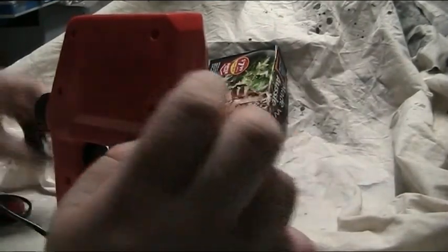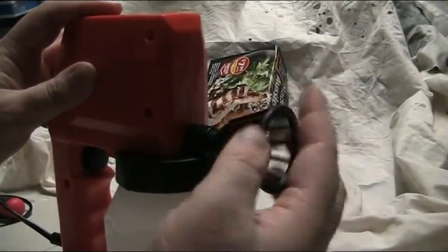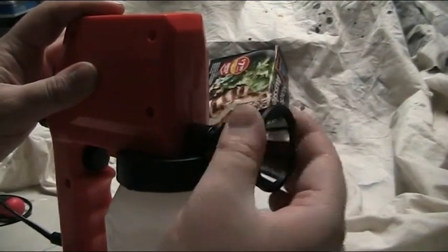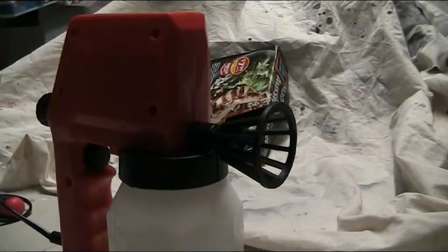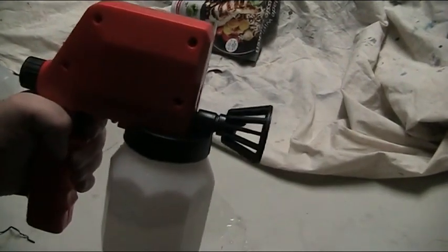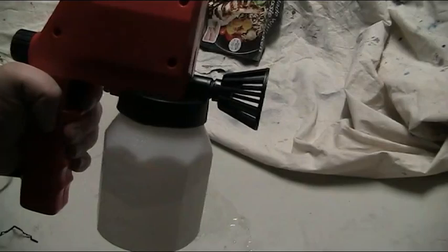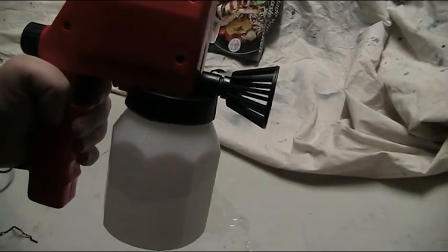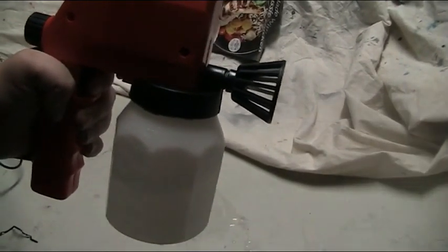The atomizer is connected in and the nozzle screwed in till tight. Note that all threaded fittings are plastic and not to be overly tightened — be very gentle as they have a tendency to snap and break. The operation of the motor can be very alarming and surprising at first. The sounds it performs are correct and normal operation — a very large and continuous buzz, far louder than your contemporary hobby or oilless compressors, about as loud but not as constant as a larger full horse powered oiled compressor.